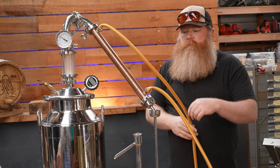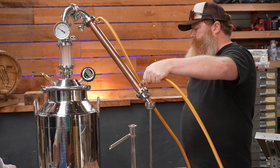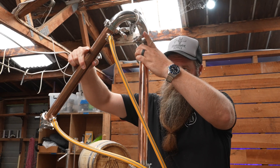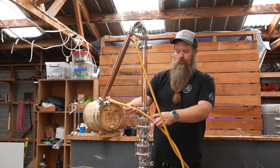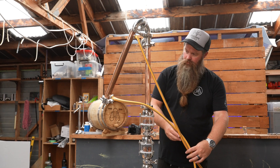These are highly efficient, high output condensers that use groundwater to condense the vapor. Essentially, the condenser is a cold water jacket that fits around the still output, allowing the vapor to condense back into liquid in the still output without the groundwater or distillate ever mixing.